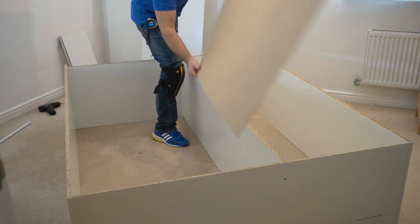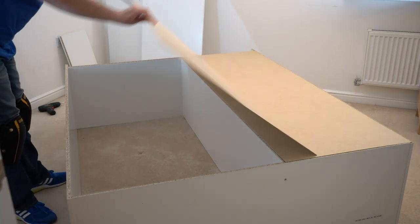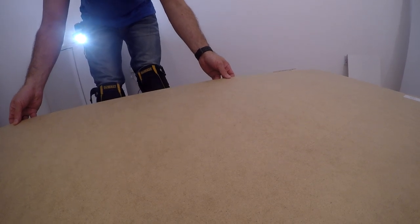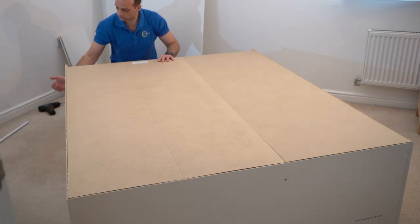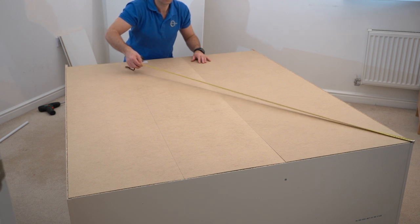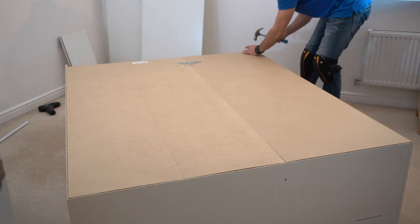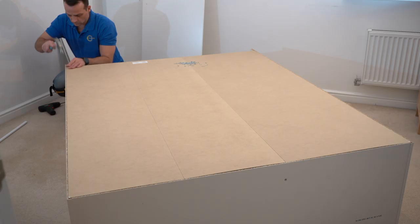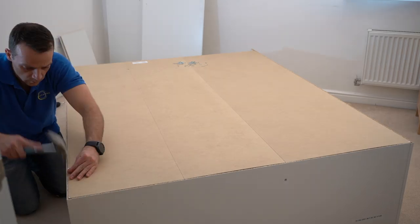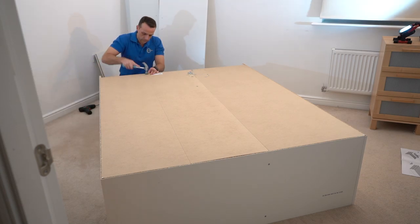Back side panel — I'm going to have two of these. One is for the shelf part, one is for the rail part. This is the one opening for the rail part. Just place them in and join them on the middle. Find the right position for the wardrobe — that means 90 degrees at each corner. Measure from corner to corner; you should get exactly the same number, and that means the wardrobe is in the right position. Now we can secure all the nails first corner to corner — the wardrobe is going to stay where it is. Place the nails all around and on the middle as well. Make sure the side panels are straight and secure the wardrobe all around and on the middle.